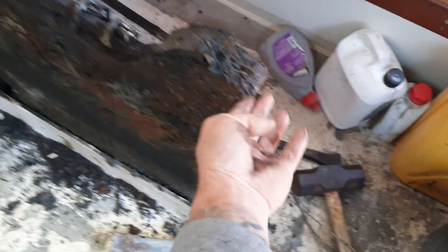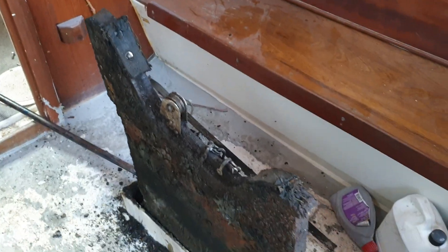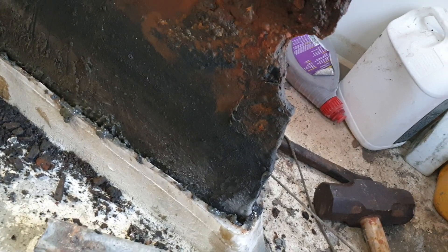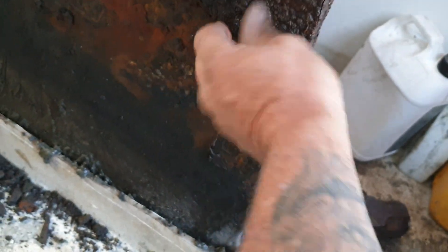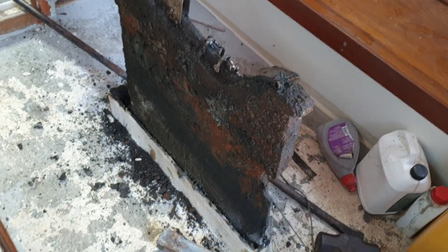Do some repairs — there's a lip on both ends and this one's broken off, and that's what was going on. It was wedged in there sideways. It wasn't so much rusty at all, it just needs a good clean. And it's had a hit sometime — there's a chunk out of it here. I'll have to weld a bit of plate in, pick all this rust out, grind it and neaten her all up and put her back in.